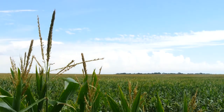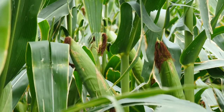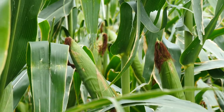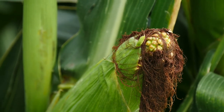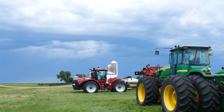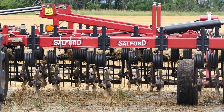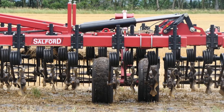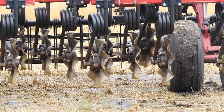It's kind of hard to pinpoint down, but I do notice that when it does get hot in July and August and we're a little lacking in moisture, our crops seem to hang in a little better. As far as when we transitioned into minimum till/no-till, we already had a Salford — basically it's a wavy coulter that just runs through the ground and flips the soil around. It's not a shanked machine at all; it's just working the top few inches of the ground.